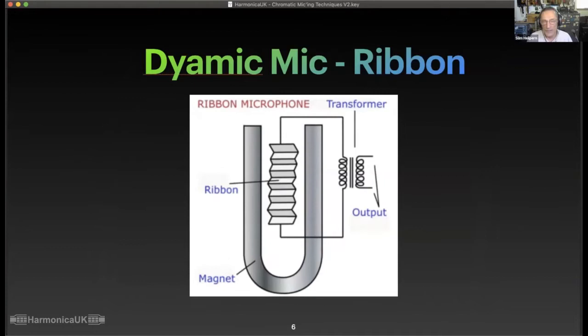They generally don't have a strong ultra-high frequency response when compared to a typical condenser mic, and unless they're built with active electronics requiring phantom power, the output is somewhat weaker and therefore requires a really good mic preamp to cleanly boost the signal. But regardless of these minor drawbacks, ribbon mics are highly regarded for their very natural sound. Note that ribbon mics pick up sound in a figure eight pattern, and I'll have more on that soon.